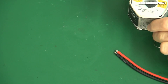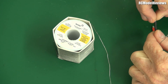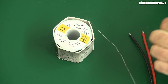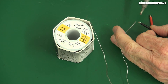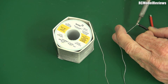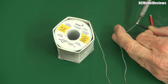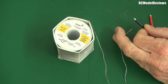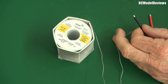You're going to need some decent solder as well — always get the good stuff, not that horrible tin solder. Get decent lead solder. Make sure that you've got the wire twisted so that no strands are poking out, because a stray strand will ruin your day. Then put a little bit of solder on the end of the iron to help conductivity, and heat the wire while feeding the solder in at the same time. Now this piece of wire has all the strands held together by solder that is wicked in — it's like a solid piece of wire.